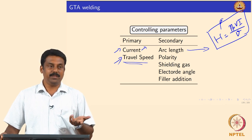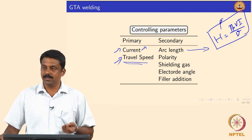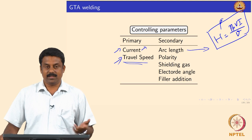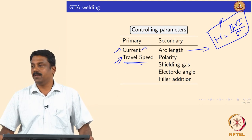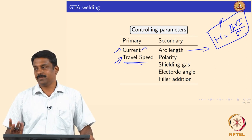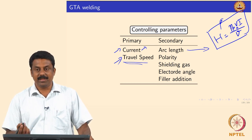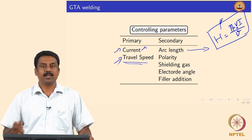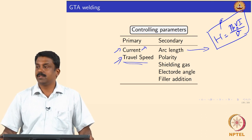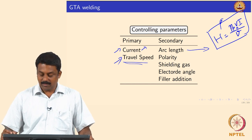We cannot play around with arc length freely. That is why during arc welding the rate-controlling parameter is always current — voltage is a derived byproduct. You cannot really change voltage independently because it is a byproduct of current and arc conditions. You can change arc length, but voltage will change with it, and you cannot change it significantly to improve arc energy without affecting arc stability.